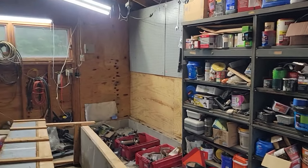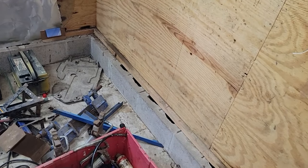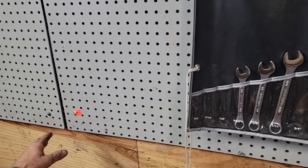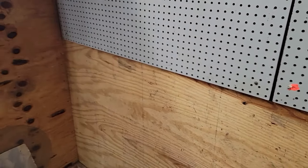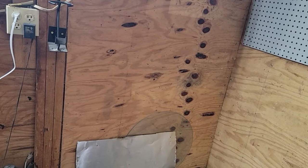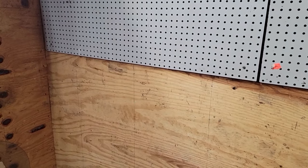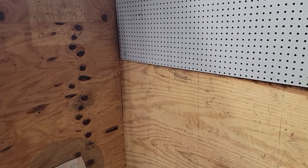As you can see, I had enough stuff on that bench — it was built into place. The legs are different lengths because they sat up on that wall. These pegboards appear to be on with just some Phillips screws, and I think it's probably plywood behind it. By looking at the crack right here, it looks like there's fiberglass with a paper face on it. If there is insulation, there's no reason to take this plywood off. Why would you go through the trouble of putting plywood on and marking stud locations without insulating it?